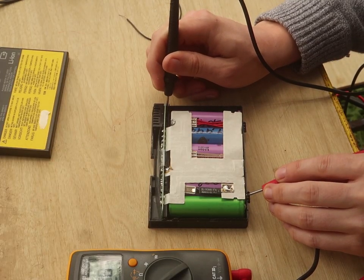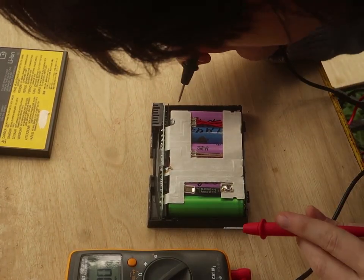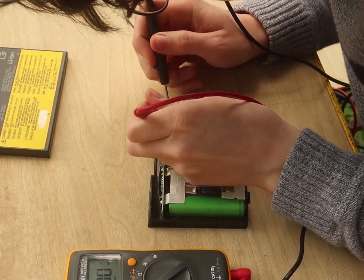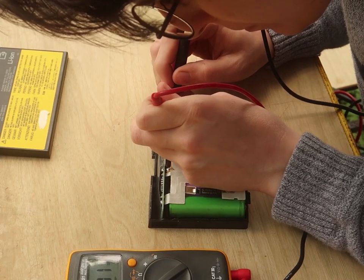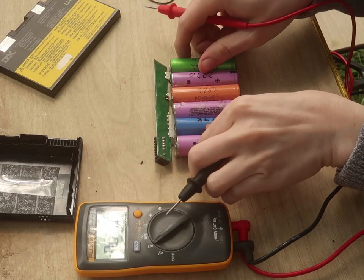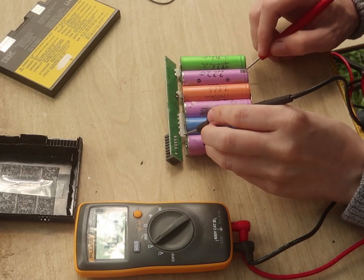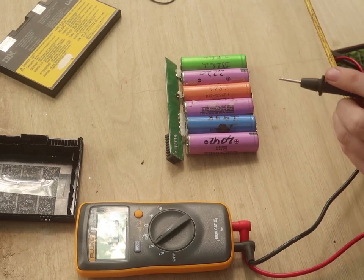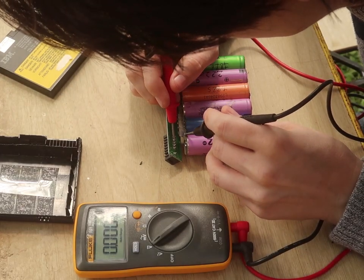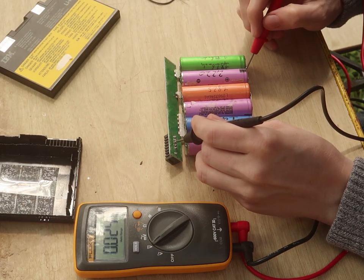Difference between 9 volts there. I'm trying to figure out how the power goes. I believe it's probably this. Because there was a voltage difference there. So I've looked through the traces and I've flipped it over and watched how the traces go. And so this is negative and this is positive. 10.78 volts. Good. And so then if this is negative, then this should be positive.